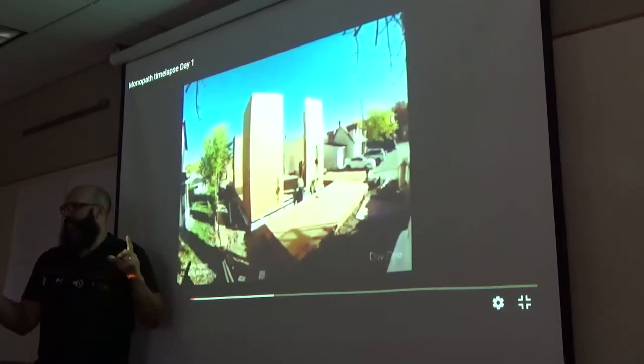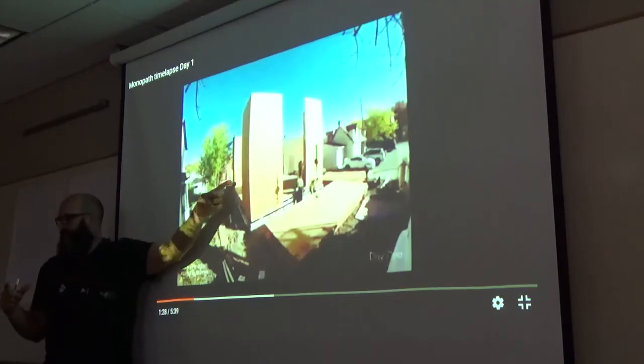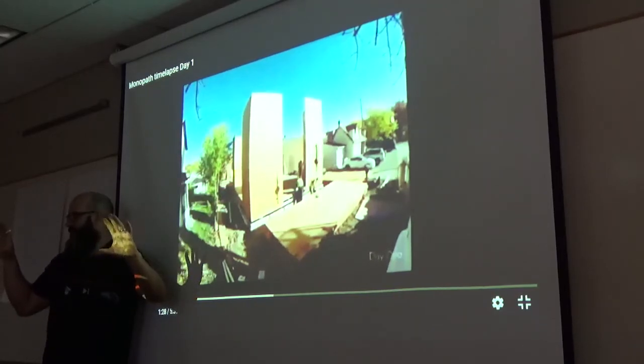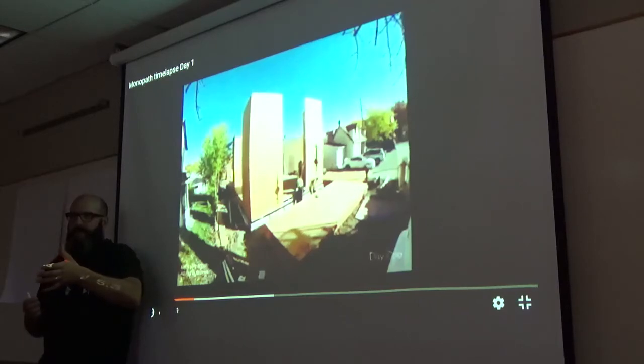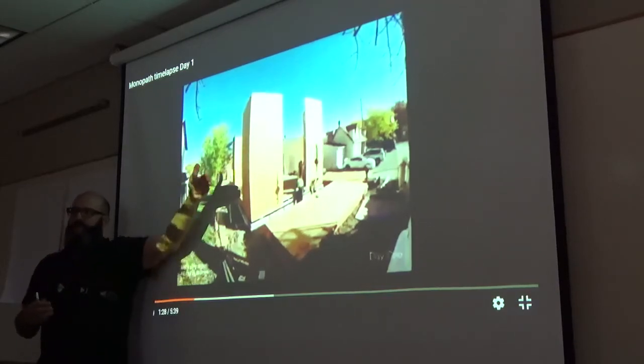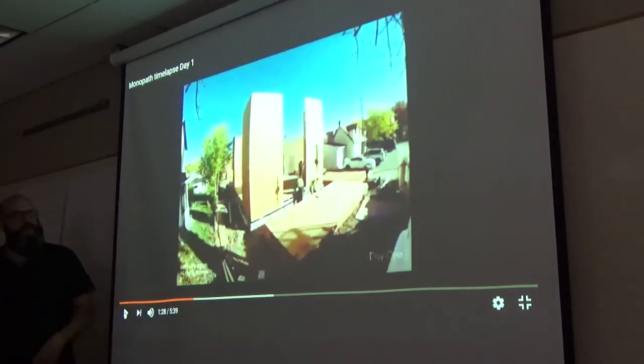You're going to find in a couple locations, that's one of them in the setting of those panels, where you're just going to get some 2x and span that gap, tack, tack, tack, and then throw a bracer out on the ground, tack it, right? And that gives you some stability. So that's already going on, which then when you set that truss on top of there, you've got a little bit of stability to deal with there.